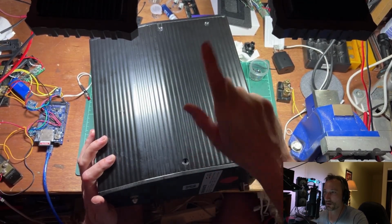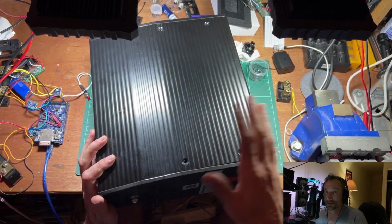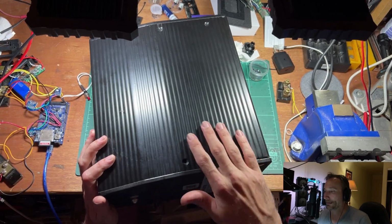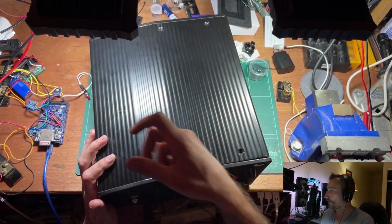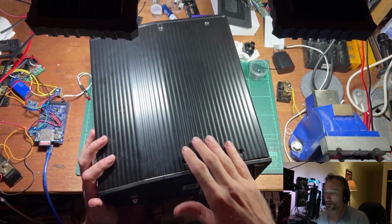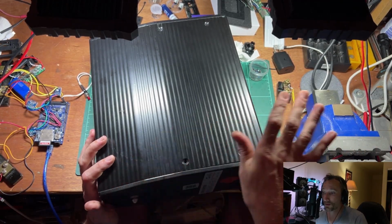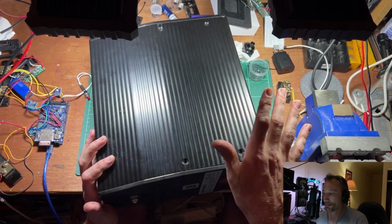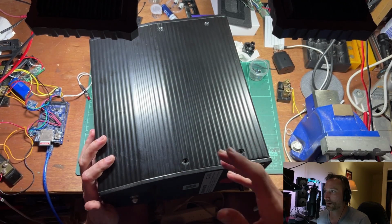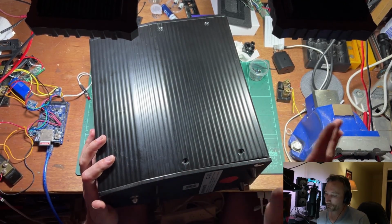Now, the 0 volt activation battery revival function on some external chargers, for that reason, it's not a good idea, generally. It's stupid. If a lithium battery's been sitting at 0 volts, like you grab one and it's been sitting in the cupboard for God knows how long, and you go to charge it and it's sitting at 0 volts or like not far off, it's done for. Just throw the thing away. Well, recycle it, get rid of it, don't charge it, because anything could happen. It could charge up and it could be usable for a bit, and then you could have a problem. You just don't know. It's absolutely not worth it.